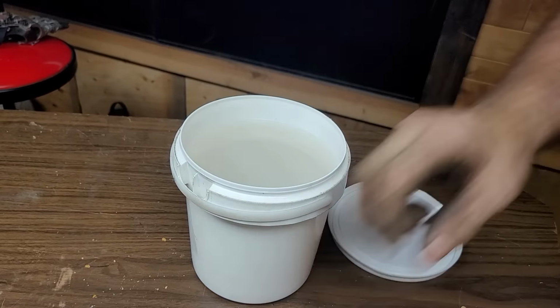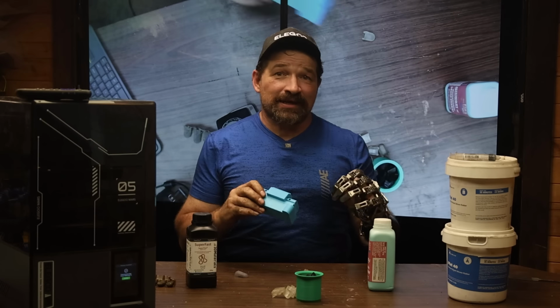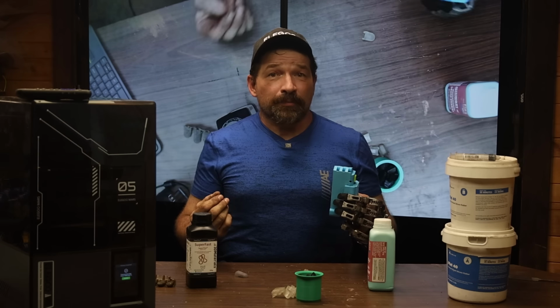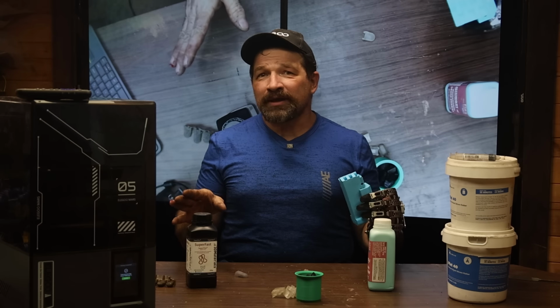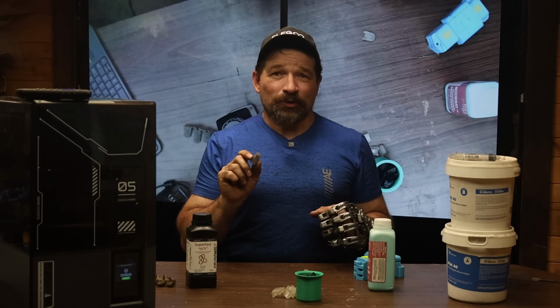In the past, I've made videos showing my casting process using Alumilite two-part Silplat silicone in 10, 20, and 40 durometer. The 10 and 20 are awesome when it comes to grip, but are super lacking when it comes to durability. If I'm using them for anything shop-related, they fall apart way too fast. The 40 is way better, but still, for shop work, kind of a no-go.